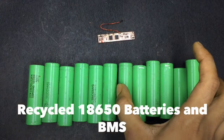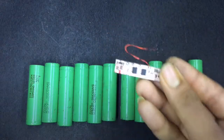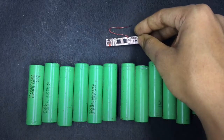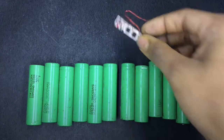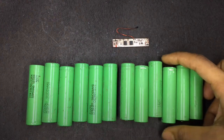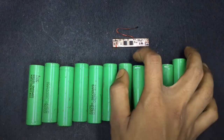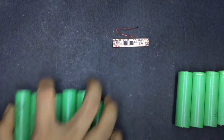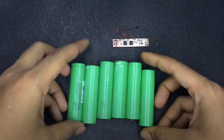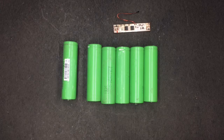So obviously you need some 18650 cells, and these are recycled from old laptop battery packs, and a BMS or battery management circuit for a 12 volt battery pack. You can buy them online, although I recycled this from a laptop battery pack and now it's working fine. You need 3 cells for a 12 volt battery pack, but I'm gonna use 6 of them to make a battery pack in this project. If you want to know more about how to remove these batteries from laptop batteries, check out my previous power bank build video, link in the description.